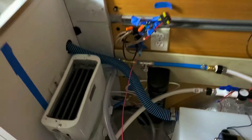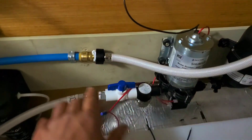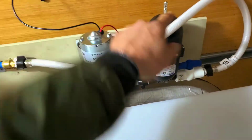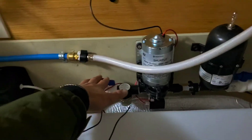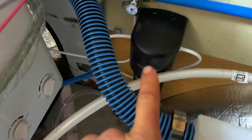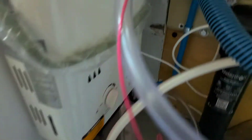Attached to the water tank is our fill line, our air, our line out to the pump, and then a drain. Over here we have the silencer lines on either side of the tank to dampen the vibrations, the water pump accumulator, and on/off valves so we can isolate things. Then we go out to a split — a white first T split that goes out to the drinking water filter, and a second white T split that goes out to the cold line and then to the hot water. If everything is working correctly, I should be able to produce not just pressurized water but hot steaming water on demand.